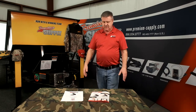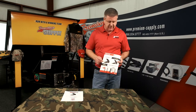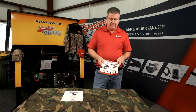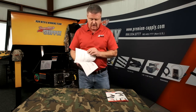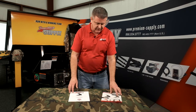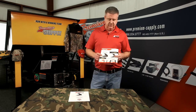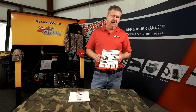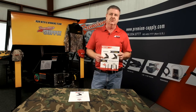Short of putting a hydraulic hoist on this table, we have a couple of ways we can talk about hoists. Here's our company brochure that we hand out at trade shows — shows you a couple of pictures. We have 11 different models available, and here is our installation manual which has all 11 models in it depending on your requirements, from a small trailer to a very large trailer. One of the advantages of going with a hoist is you're going with a much smaller cylinder so your pump doesn't have to run nearly as long, so you're going to get more dumps out of your battery life. Anybody asks me the most efficient system — this is it.